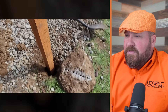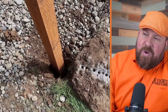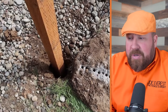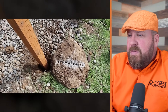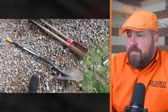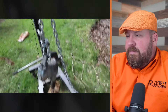So we have here an eight-foot post that's down inside of a two-foot hole, so we have six feet coming out — not to ASTM standards. ASTM would ask for a 30-inch hole, eight-inch in diameter. I like that it looks like he's using a four-by-six pressure-treated instead of a four-by-four, giving him a little bit extra mass there. The basic tools you're going to need: a set of post hole diggers, a shovel, and a roto hammer attached to a cherry picker.